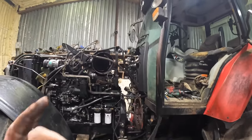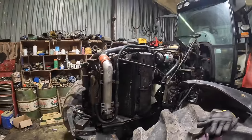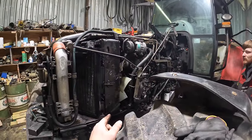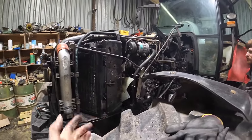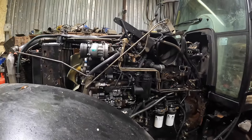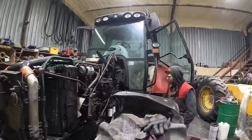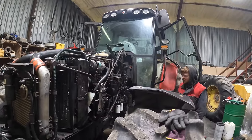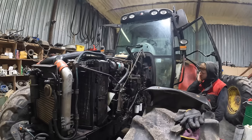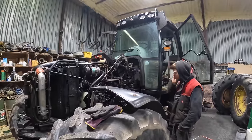So, anyways, to get that done, and then while the loader brackets are off, go tackle the crankshaft seal. In case we have to move to take the tombstone off, it's just easy done now while the brackets are off. And then the pump as well, if we can convince him. Has he been convinced to do it yet? No. So you're kind of just waiting for him to come back now. No, I'm going to make the plate for the bottom of this pump. The extra bracket, the back of it. Oh, okay. It's never done yet. To keep the pump from falling off like it did last time. Yeah. Support for the back of it.